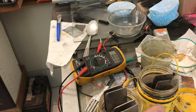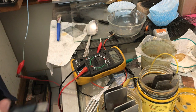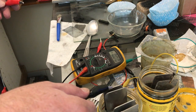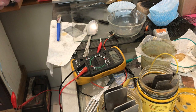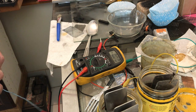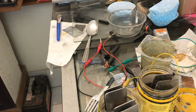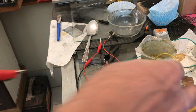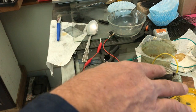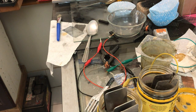This plain one has no extra carbon, only the carbon felt it's applied to. Same ratio roughly — one gram of each material, slightly higher on this one. I'll give them each a charge one at a time and keep the charge at two volts, no more. I'll start with the plain one so we can get an idea, since we've sort of seen the other ones running. I'll set that up, put it on charge, and I'll get back in an hour.